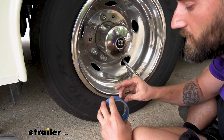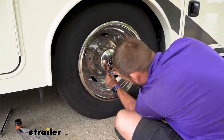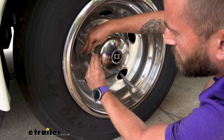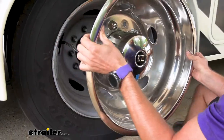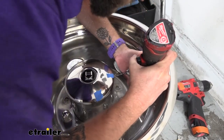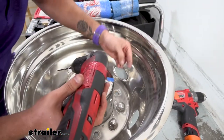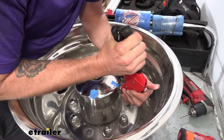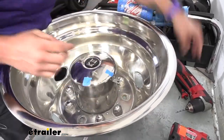What I'm going to do is just take a little piece of painter's tape and mark my locations. Then we can pop this off and get our brackets riveted into place. I'm going to eyeball it and just get my hole started here, then we can match up our other hole. I can go ahead and insert my rivet, and while that's holding it in place, I can drill out my other hole and get my second rivet in place.